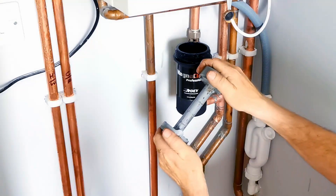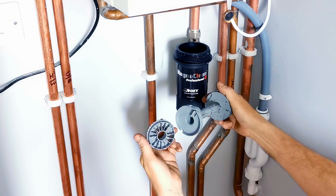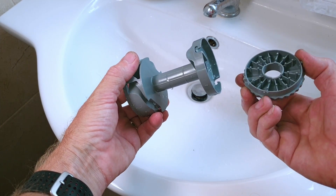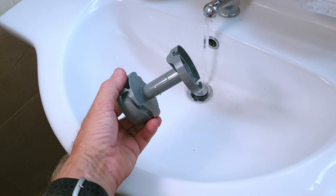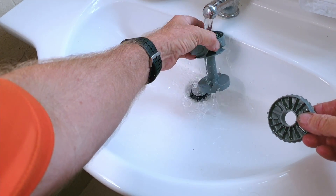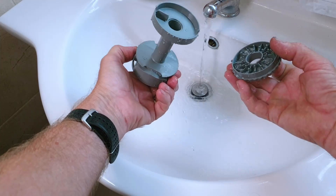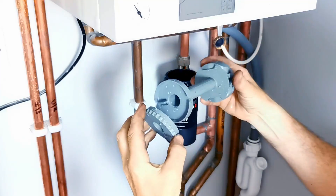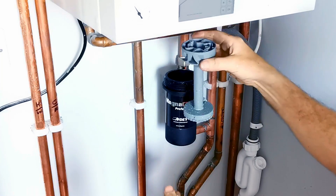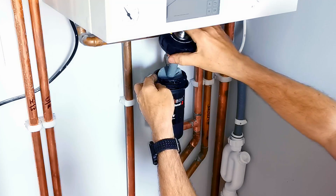I've now removed the plastic sheath from the magnet — be careful you don't lose any magnetite when you do this. You can then unclip the cover from the non-metallic capture area. Give it a good wash off, making sure the whole thing including the top and bottom are all nice and clean. That's all clean now and ready to be refitted. Clip and rotate that bottom cover back on, then either drop it in the pot or put it onto the magnet and put the whole thing back in.